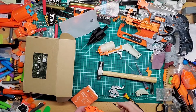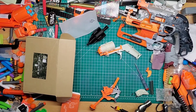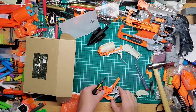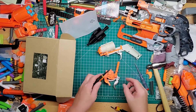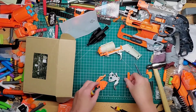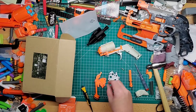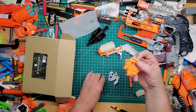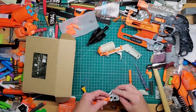Okay guys, so I got it. What I did is I got a smaller punch, put the pins basically over the replacement piece, and just tapped a little bit and it came out on both sides. There it is. To get it out the rest of the way you can just use some pliers if it doesn't come out all the way, but mine does so that's a plus. So this old one you can get rid of; this new one you're going to put in its place.